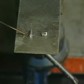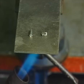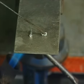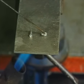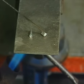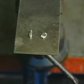It is not always possible to know whether a type of cast alloy will melt below the melting point of technoweld just by looking at it. If the metal melts at about the same temperature as technoweld, or even slightly before, then you apply technoweld using a different technique. To test the melting point of a suspect metal, place a small piece of technoweld and a similar sized sample of the metal on a flat metal surface, and heat evenly from below, checking to see when the sample melts. In this case, it is melting at just about the same temperature as the technoweld.